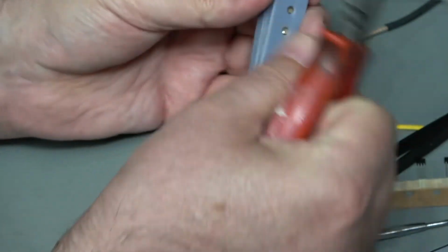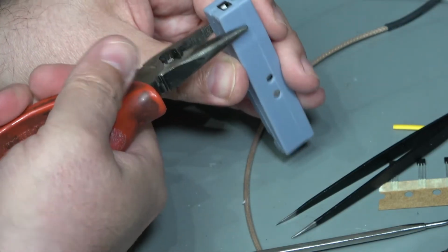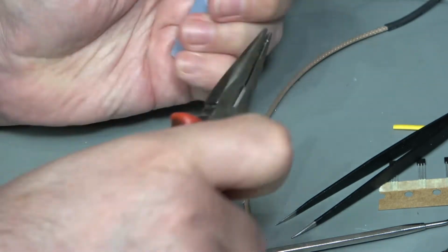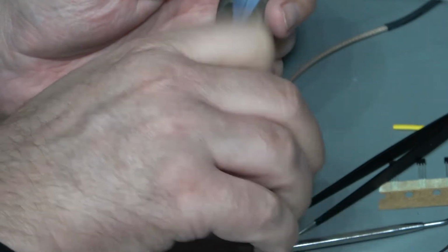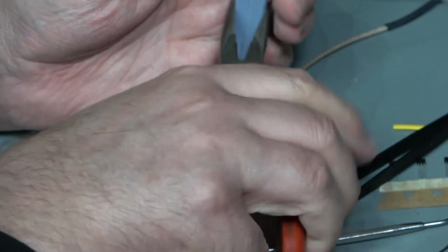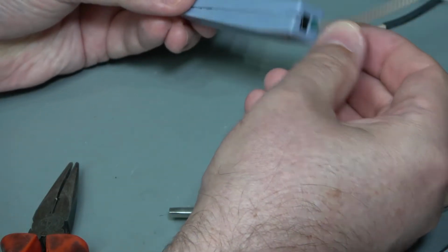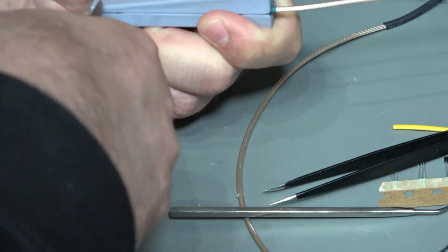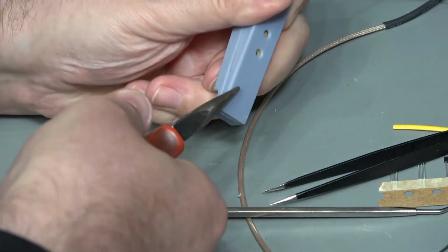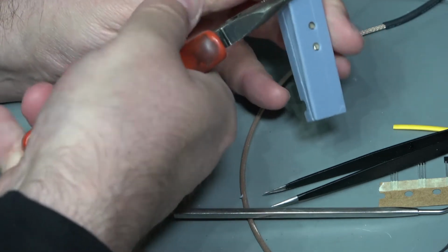So we've actually still got the same problem that I had in prototype 4, whereby the case has got a tongue and groove around it, and the tongue and groove was too tight. There wasn't enough clearance on it, and as a result, the case wouldn't fit together perfectly. We've got the same problem again here. The tongue and groove is still too tight, so I'm having to lever it in, and it's not clipping into place as I would hope. So it's there, but not quite.